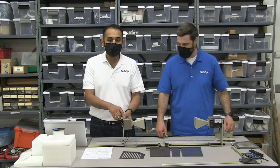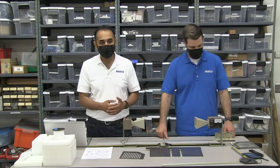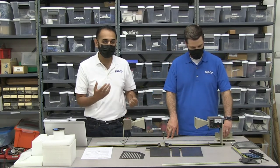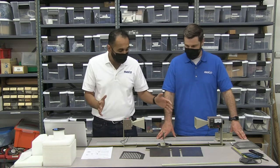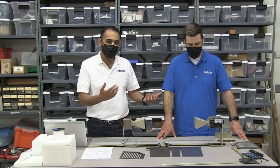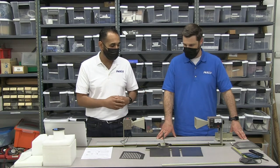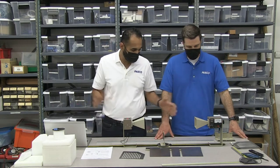The transmitter transmits. The wave is about 10.5 gigahertz, and it's only about 15 milliwatts, so it's not a strong wave, but it's there. Everything we're doing, we're setting the transmitter and receiver somewhere up to about a meter apart. They're not too far apart, but it's strong enough to pick up the signals at about one meter.